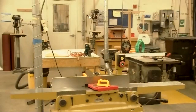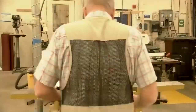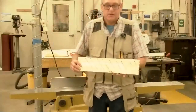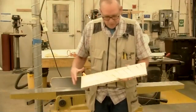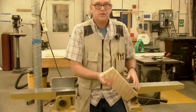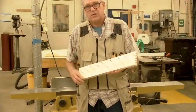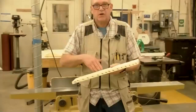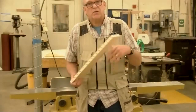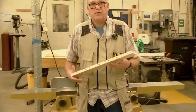When we talk about first doing the faces — the thickness of a board — what's actually not a bad idea when you're first starting out is to take a pencil and make pencil marks all over both faces, both edges, and both ends as well. As you move through the process, when you think you're done, all these marks should be gone. In other words, we have to mill every single surface on this board. We start with the face — the thickness of the board. The first thing you see me go to in thicknessing a board is the jointer.